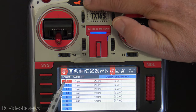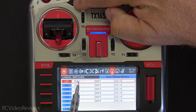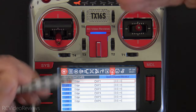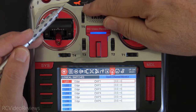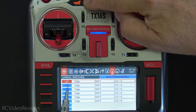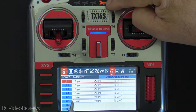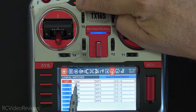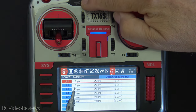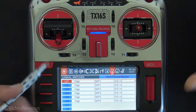Now I'll show you what happens when I press the buttons on the top row. Starting with position one which is already lit — notice when I press it, nothing happens. That's the light switch scenario: if the switch is already in the down position and you press down again, it won't change state. However, if we press two, logical two lights up momentarily. Hitting three, four, five, six each light up in turn, and then pressing one again it lights. You can go back and forth between positions, you just have to get off the switch you're on.